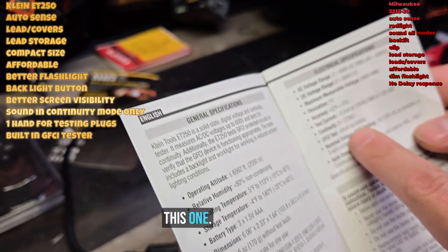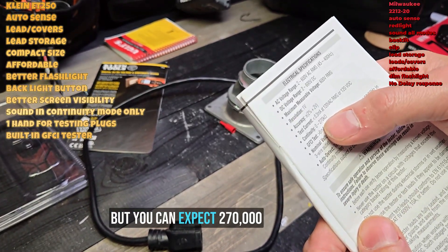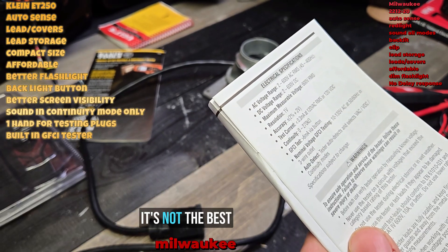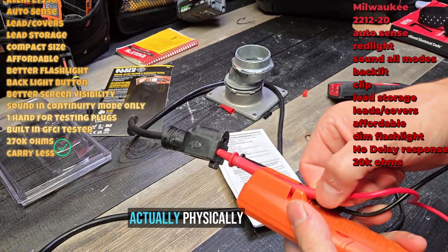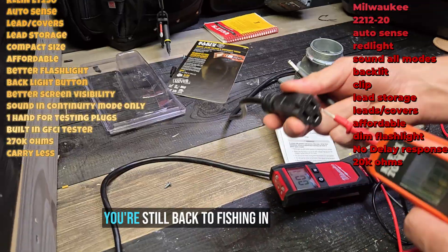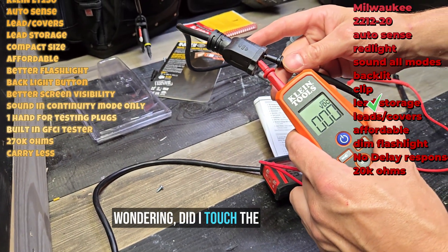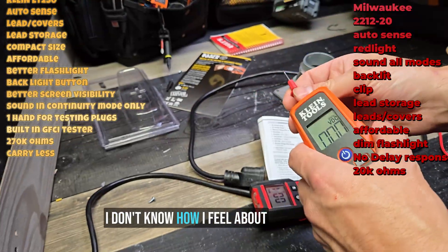On the Klein's specs, you can expect 270,000 ohms input impedance — 270k — and that's your accuracy. It's not the best troubleshooter but it does work well. To unplug one of the leads it's actually physically difficult, so you're going to have to fish around. You're still back to fishing in the dark and not knowing if you have voltage because of the delay. So you're wondering: did I touch the right spot or not? I don't get a beep, I don't get the visual — I'm not sure how I feel about it.